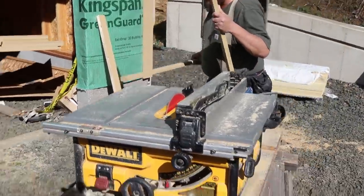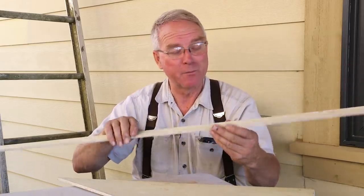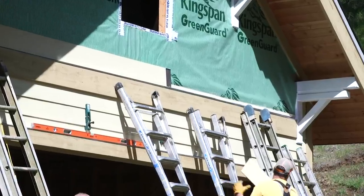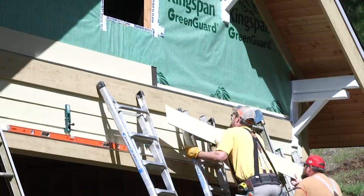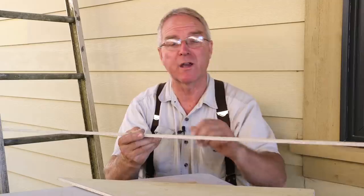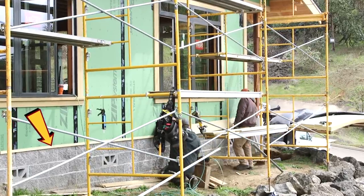The next really common kind of cut in almost any carpentry is a rip — a cut that is parallel to the long axis of the board. A rip is also a noun: this is a rip, the piece that comes off after you have ripped a board. This is an example of the starter strip that we ripped off the edge of a piece of siding, installed behind the first course with the factory edge down, to provide the kickout in the bottom course — so the appearance of the siding is uniform from top to bottom.